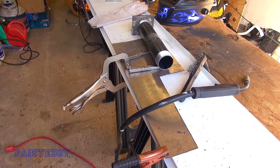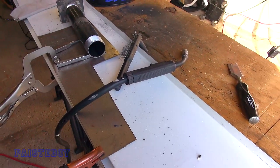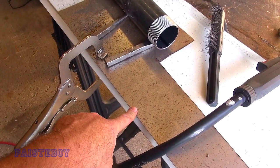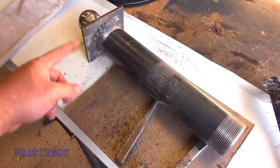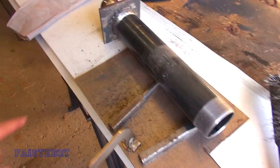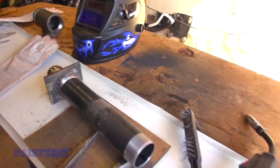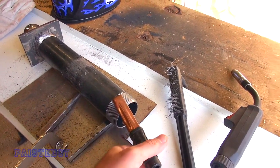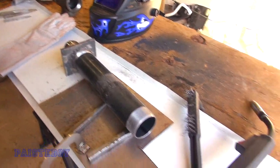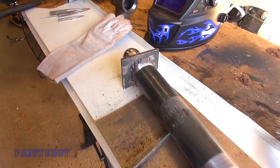I'll quickly show you my little setup — a piece of plywood down here, a piece of aluminum flashing left over from putting it on the house, and a piece of steel clamped down. So once any part of that pipe is touching the steel, now all you have to do is ground the steel and the whole pipe can be welded. If I would have just left it on the wood, it wouldn't weld, because you have to have this grounded. I'm no expert, just explaining that you need the part you're welding to be grounded — I like to do it off the part and it works.